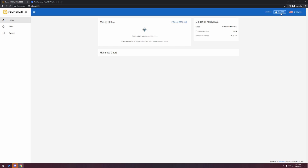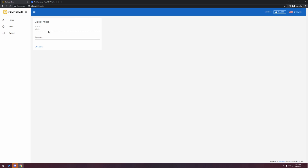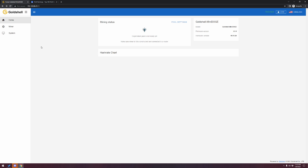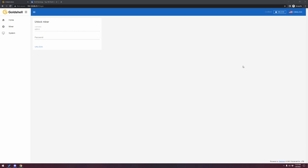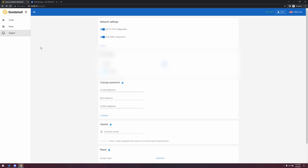Next step is to unlock the interface — click on lock, and under admin you type the password. The password by default on all these devices is 123456789. It is always a great rule of thumb to stop and change your admin password. Go down to System, and under Change Password you type in 123456789 for your current password, then put in a new password twice and hit change. It brings you back to the unlocker screen — type in your new password and click unlock.